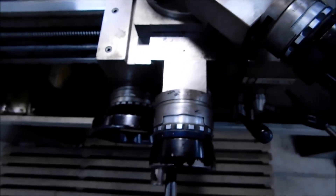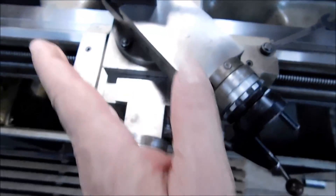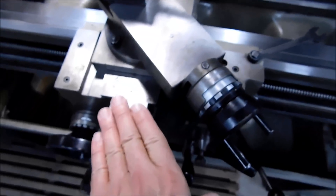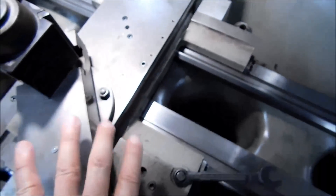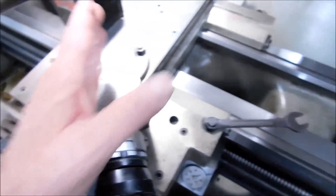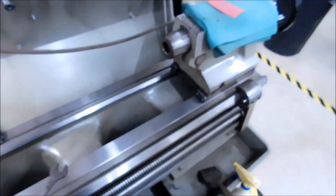Why is the compound set at 45 degrees? When I bring the cross slide all the way back, the dials will never interfere with each other. The 45-degree angle also lets the tailstock come in without bumping anything. If you leave it set perpendicular to the cross slide, sooner or later you'll encounter a situation where you just don't have enough tailstock reach to accommodate your thread.